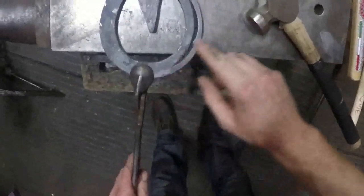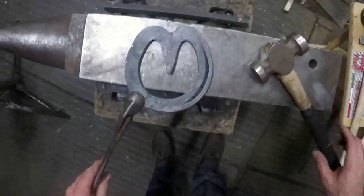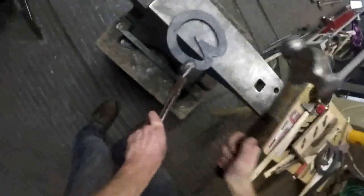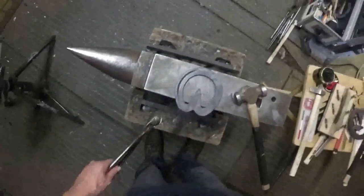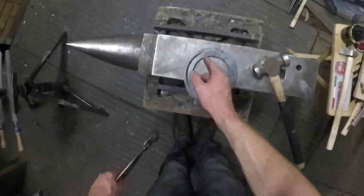So at the moment, it's taken all the edges off there at 45 degrees with the hammer. The anvil's taken all those little corners off there, and then it just wants a nice levelling. Then you've got quite a nice branch. So I've got to do exactly the same to that branch as I've done to that branch, because that will have stretched it, not significantly, but it's probably stretched it by 1/8 of an inch, knocking the fuller and edges off, fullering it, and knocking the corners off.